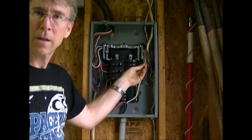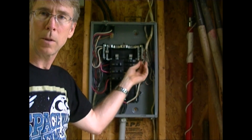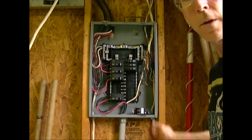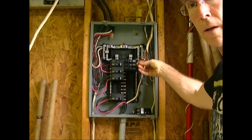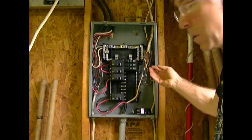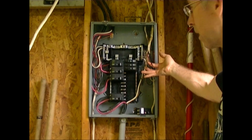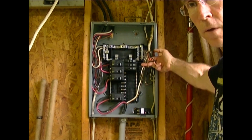Once you've run the cable into the box, you can go ahead and hook up the breaker to the conductors on the cable and install the breaker. I'm going to go ahead and do that and just leave the breaker off because I haven't installed the other end of the cable yet. To install the wiring: we have a bare copper wire, a white wire, a red, and a black. The black is always hot, whether it's 240 or 120 — black is hot. Red is hot in a 220 line; it's the other side, and the black and red are 220 volts apart.